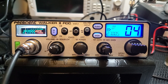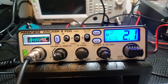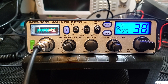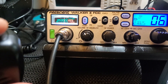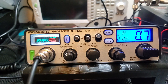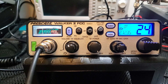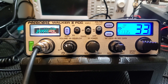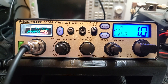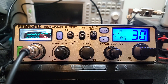I had to go to the right antenna so it's kind of quiet here right now. We have channel scan on, which is simply: put your auto squelch on or adjust the squelch to a level you need to block out noise, then just hold the up button on the microphone until you see that little decimal point start blinking, and it will simply go into a channel scan and stop when there's activity. That could be useful if you're driving down the road and don't really know where people are talking — you can just set it to scan. A lot of other President radios have scan also, so it's a nice feature.